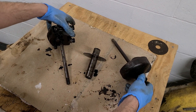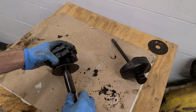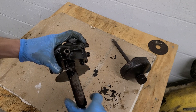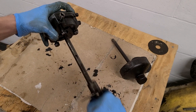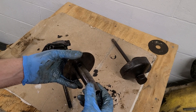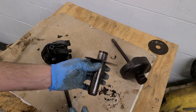Once you take that off, if you look up inside the canister housing you'll see this piece in there. In order to get the oil head off and disassembled, you've got to take this piece off. There's a special tool the manual says to create — you get some steel rod, bend it a certain way, and use it to grab the two holes in the piece and hammer it out. I have a video on making that tool; I'll put a link in the top right and in the description.